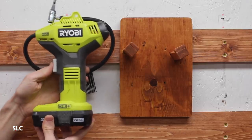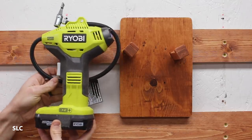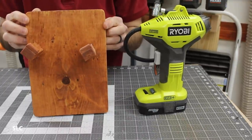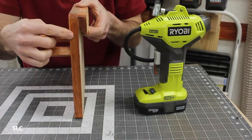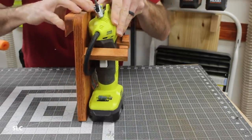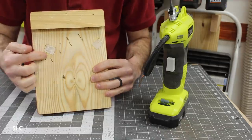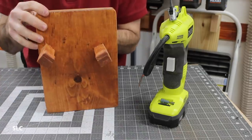I recently purchased this power inflator so that I can help with airing up tires, or if the wife needs to check her tires. So I needed a holder for it and I created this very simple design so that it can hang right there. This is very simple — I actually used some old scrap wood, roughly three quarters inch thick. For these arms reaching out, I made sure they would fit just long enough so that I could have an additional lip right here, so there's very little chance of this ever sliding off. For strength, I drilled and cut the holes all the way through the main back support, slid these in and glued them in place.